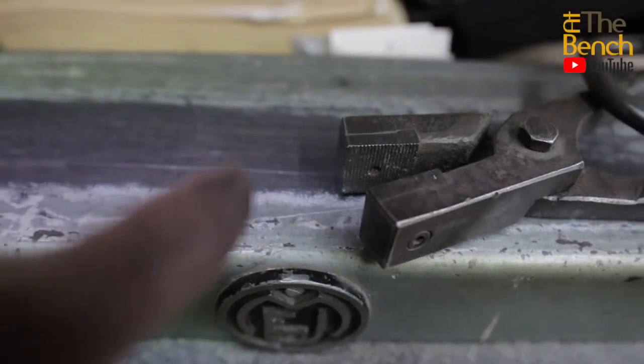So when you work the metal, you actually work harden it. Now, if you've rolled it or you've hammered it, you need to anneal that end section just to make it soft again. If you filed it, it doesn't matter. You haven't work hardened it. But the idea is, if you don't anneal the end and it's still hard from when you've hammered it or rolled it and you put it through the draw plate, your draw tongs will not be able to grab onto it tightly enough and pull it through, because the metal is hard and the serrated ends on your draw tongs, you can just see the serrations on the draw tongs there, they won't be able to have a good grip on that bit of wire. If you anneal it, it's nice and soft, they'll be able to grab onto it and you'll be able to pull that wire through the draw plate nice and easily.